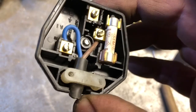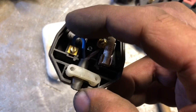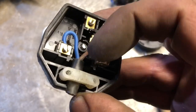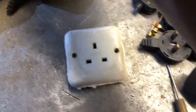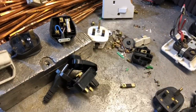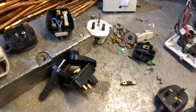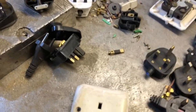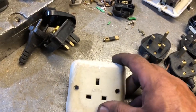The new colours are blue and brown. Take the second letter of each: blue — BL — L for left, so blue is neutral. Brown — BR — R for right, so brown is live. A useful mnemonic for when you want to wire a plug up: which one goes to the right — the hot?